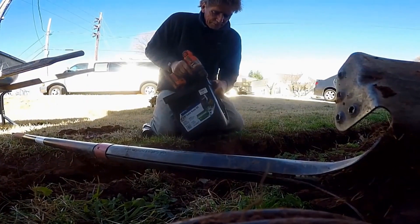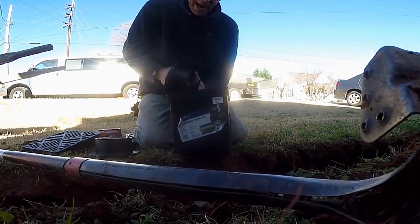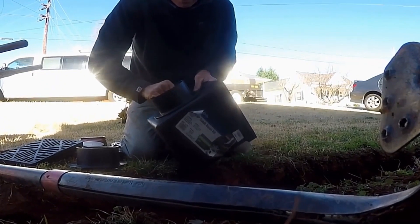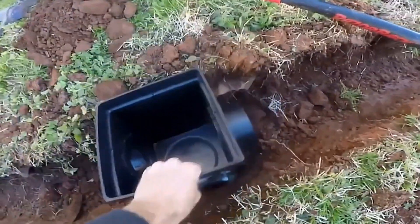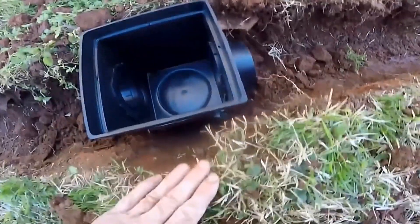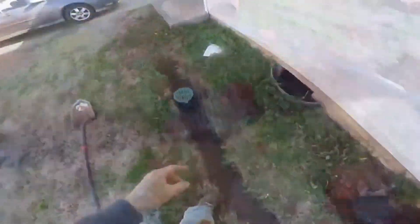So we're going to set up our catch basins. Take your drill or screwdriver, take out these little screws, and pop your catch basins open. Inside you'll find two adapters — they've got little nipples on them, four of them. Find the slot, twist and lock it in place on both sides. Pretty simple. Then we've dug a hole to set our basin down in because it sits a little deeper. We want to make sure that we're at the lowest level. You can see this side is a little bit higher, but that's just because of the yard. The grate will go on the top. Our gravel perforated pipe comes in and out the other side.